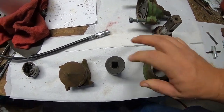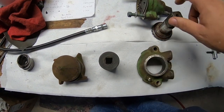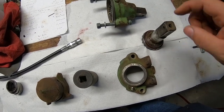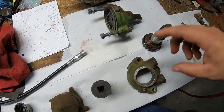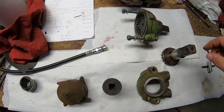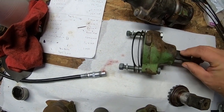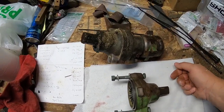On this one here, this side — which is the drive side — the seal is blown out and those bearings are seized up. But that part is in pretty good shape, so we got it all put back together. There's a roller bearing there that's in good shape. So we're going to pull this one apart here. I did this one just to kind of see what was involved in it, so now I know what I have to do. This shaft end is a little worn compared to this one here — it's squared up pretty good. So that could be part of it, but I'm sure that auger has a lot to do with this.